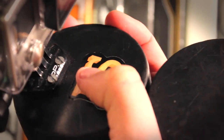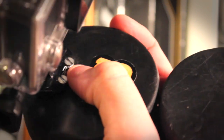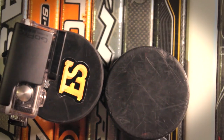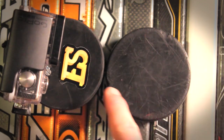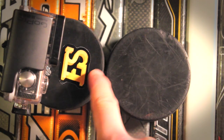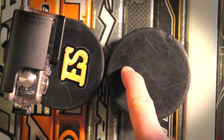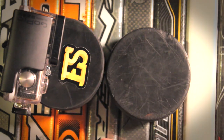That allowed me to, when I put the mount on, screw these guys in and tighten it right up to the puck. Really, this whole mount is pretty easy — it's just drilling a hole into each puck and tapping them quarter-20.